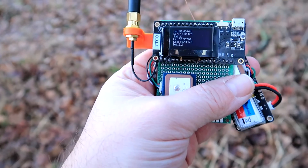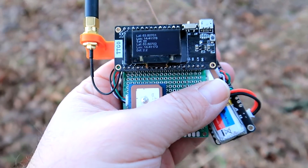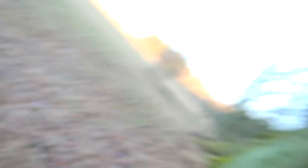Of course, as you can see, there's still a difference of more or less two meters. This is because of how GPS works: each module, depending on the noise around it, the position, and the module itself, can give you slightly different readings. Plus, the accuracy of the signal sent over the air protocol is only around six decimal digits, so there is an error of at least a few centimeters or even meters.